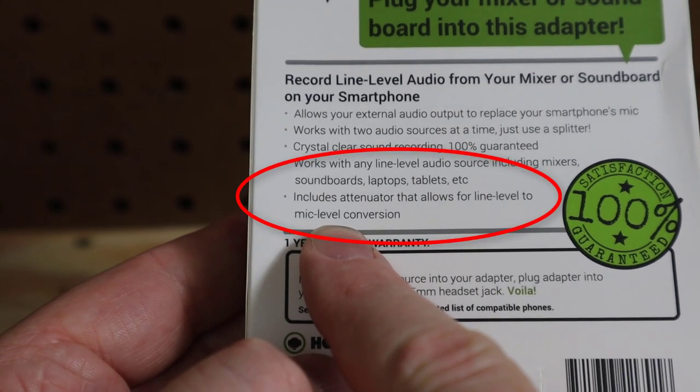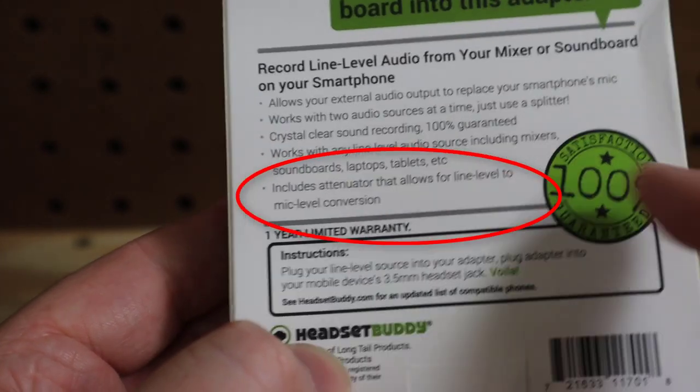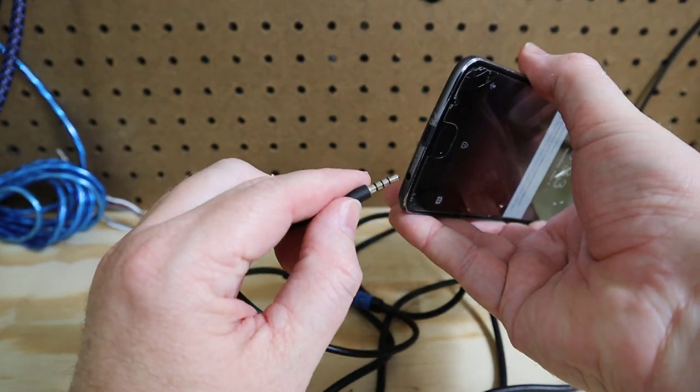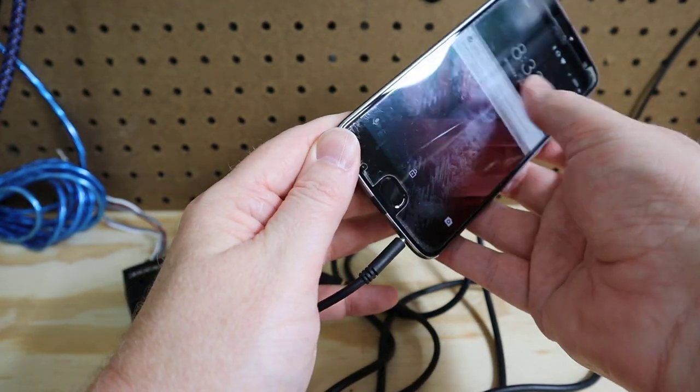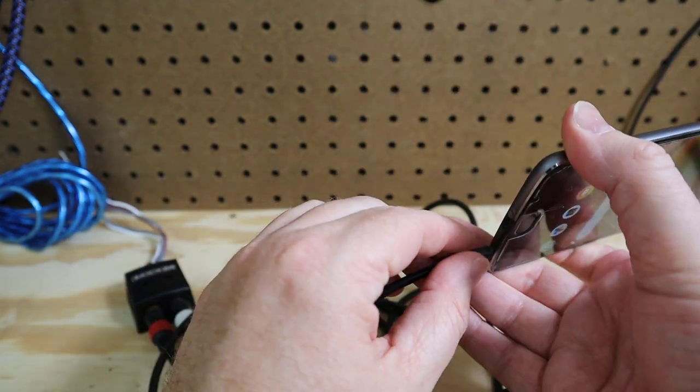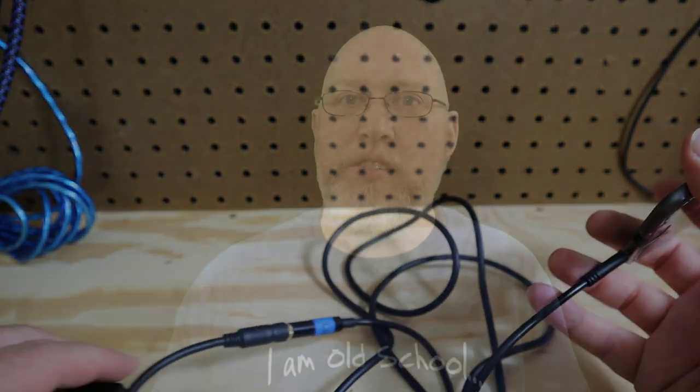This particular brand is the only one I could find on Amazon that specifically claimed to have an attenuator. An attenuator is just a fancy word for a signal reducer. You need one with an attenuator so that you don't blow out the microphone input on your telephone. Now we just plug it into your telephone. You're about to plug an amplifier into the microphone input on your phone — you absolutely cannot do that without the line-out converter, and you really need to use the cable with the attenuator. Also, don't use a brand new expensive phone for this, and note that newer phones may require an additional adapter since many no longer have a headphone jack.